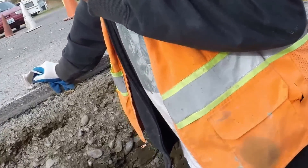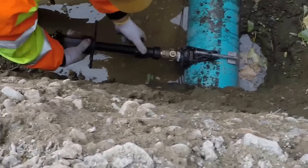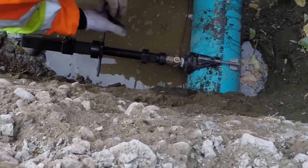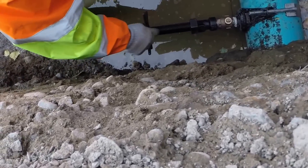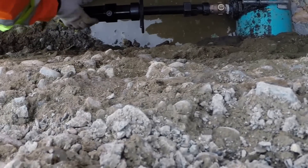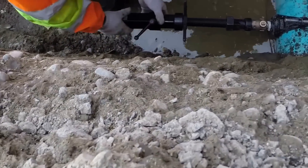This is for PVC of course. Go ahead and put it on there, tighten that down. If you get a little bit of water coming out through here or up on top, that's okay. If you've got numbers right here, try to keep those up on top if you could — we'll always start off with zero. Push that down until you hit the pipe. Once you hit the pipe, tighten it up right here. That way as we turn this, it's going to cut as we drill from the back. Tighten that up so this won't move.